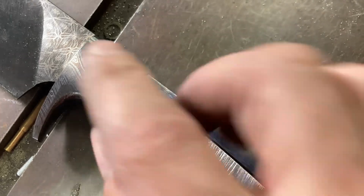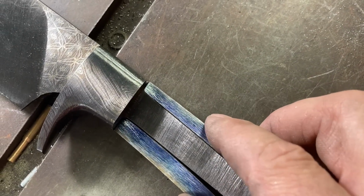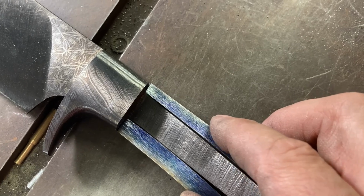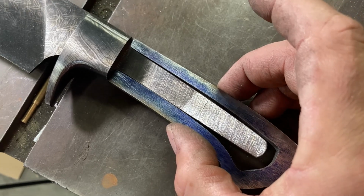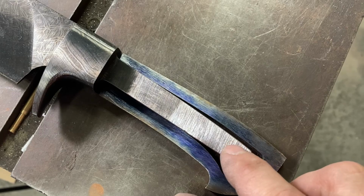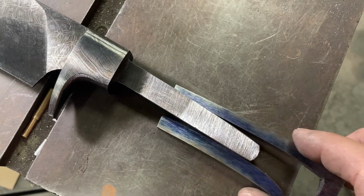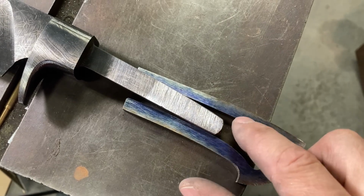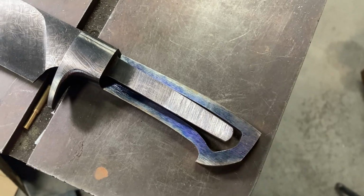And so we're going to need to actually true the back of this up, finally true the front of the frame up. We're going to need to fit some alignment pins, and then we're going to need to start working with the end of the tang, cut it a little shorter, thread it, put the block across the frame and figure out the nut and all that kind of stuff. Some fabrication.